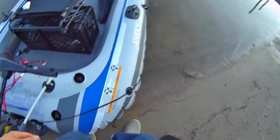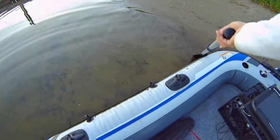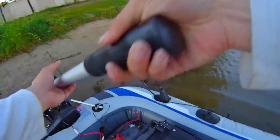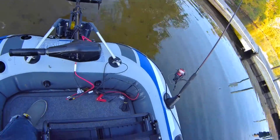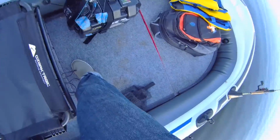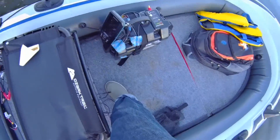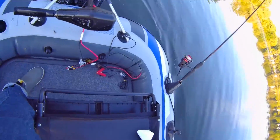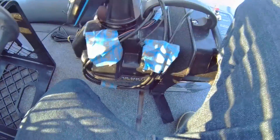So to start off the boat, what I would typically do is use the paddle to move it a little bit so that it's off from the shallow parts. The shallow parts will not be good for lowering down the trolling motor. As you could imagine, as the trolling motor spins, its blades are going to hit the bottom. So what I do is roll out the boat into 2 to 3 feet deep water before putting the trolling motor down so that the blades don't hit the bottom.